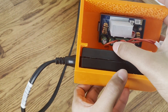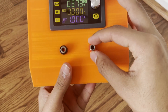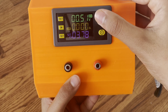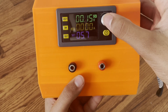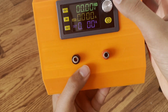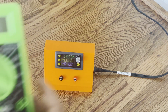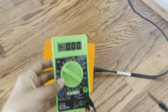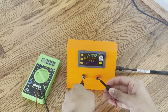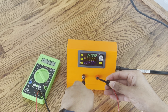The other two wires are the out minus and out plus, and these lead to the banana jack terminals. I can set the voltage to, say, five volts, and then set the maximum current to, say, 400 milliamps. Then I press the I button to send it out. I've got a multimeter here — and you can see there's 4.91 volts on the multimeter.